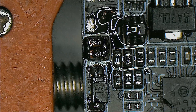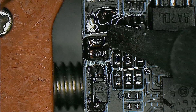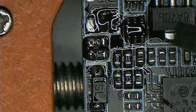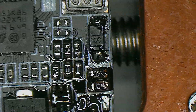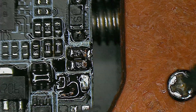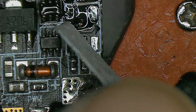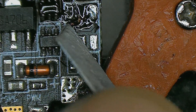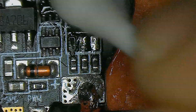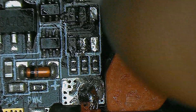We don't need to break that connection, but if we want to we can use the solder wick just to break the connection a bit. Now let's clean the other side of the cap just a tiny bit — this is just to make it look better. One more thing to do: I want to cut this trace here.